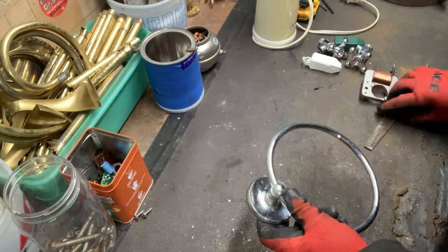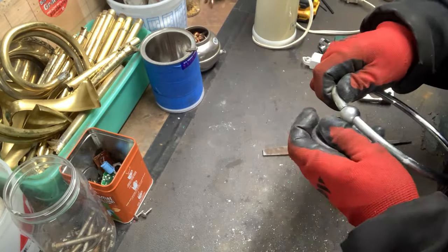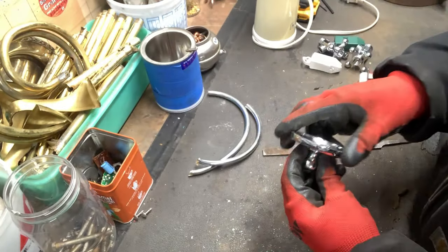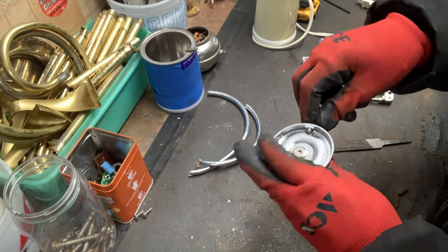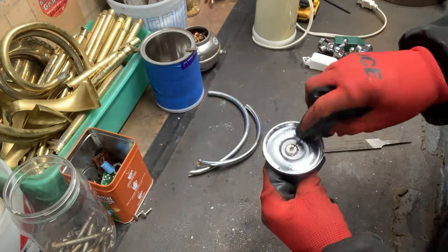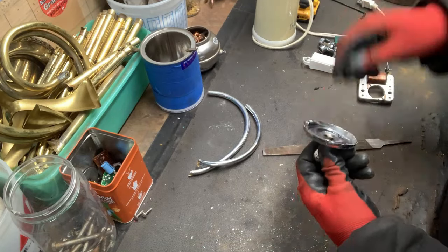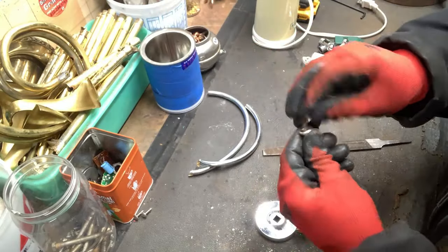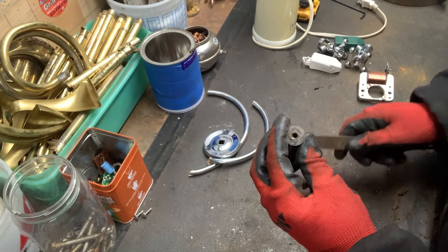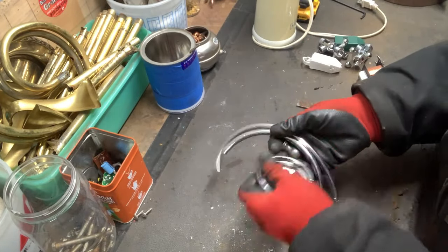Now let's get to this towel rack holder. Let's check it with the file — that piece is brass. These just pull out like this, and I like to break them in half so they fit in a bucket better. We've got some brass. There's a set screw we've got to remove — that's steel. And there's another allen screw right here to separate these two pieces. Check the file — yeah, that's brass. Sometimes they're die cast as well. Let's check this piece — that is brass as well.